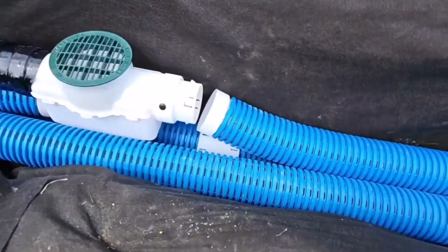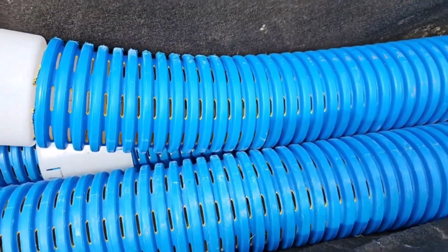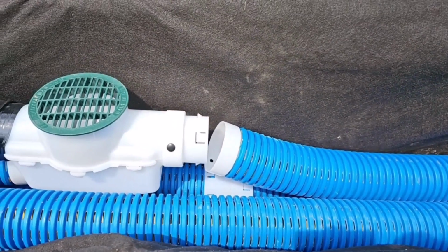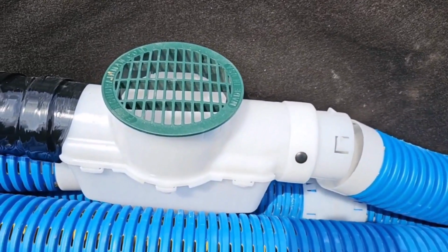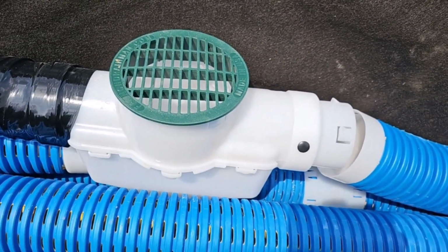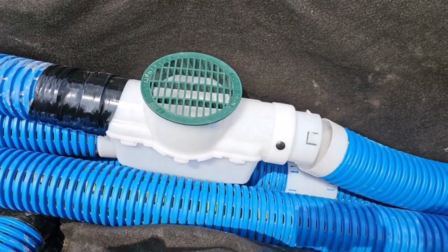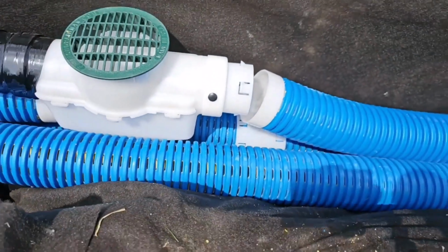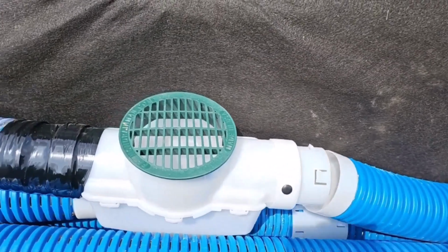So you never want to put a catch basin on a perforated pipe because you're going to get grass blades, bark, sediment. You're going to plug your perforations. You're going to ruin your French drain. So the guys went ahead and they installed a yard drain to grab the surface water because we have so much surface water here. You can see right there, they went ahead and they capped off this end of the catch basin, just put a plug in the perforated pipe so we don't fill it up with stone.